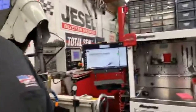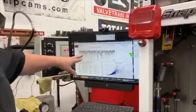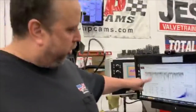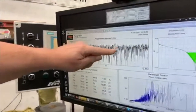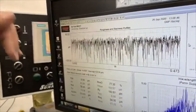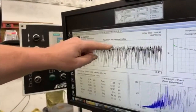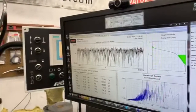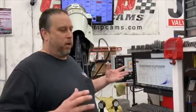Alright Brad, I want you to show the guys and ladies who are watching what's on the screen here and explain it to them. Okay, this is basically what the profilometer is picking up. All the deep lines are going to be the valley. The lines in the center, which are kind of boxed in - you can follow that red line - that would be the RK. That's pretty much the middle - the core roughness. And then the little lines up top are the peak.